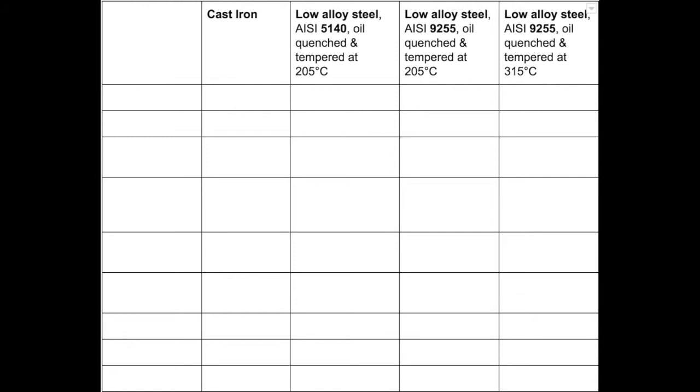Since one of the materials that was chosen with our MPI was cast iron, which is also the material that was chosen by the manufacturer of the product, we decided to use a decision matrix comparing the other materials to cast iron. A material with a property that was more favorable than the property of the cast iron got a score of 1. A material with a property equally favorable to that of the cast iron got a score of 0, and one with a property less favorable to the cast iron got a -1 for each subset.